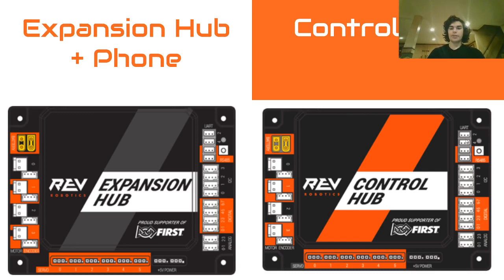Unless there is something really weird, there is no legal use for them in FTC. I believe they are just debugging ports for Rev. These two ports are used to connect an expansion hub and a control hub, or two expansion hubs together. So you will get your cable and plug it into one of these ports, and then it'll go into the port on the other one.